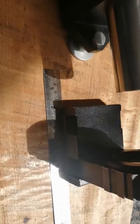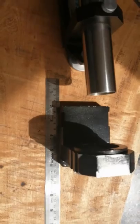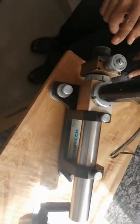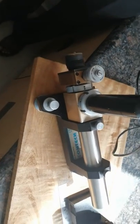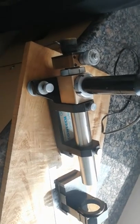Once again, you have to coincide the horizontal line, but now using the micrometer only — don't touch the initial level adjuster; its duty is over. Using the micrometer, coincide the horizontal line again. It may go upward or downward — no problem.